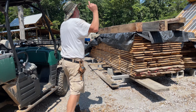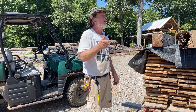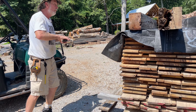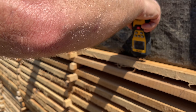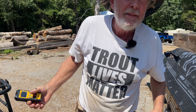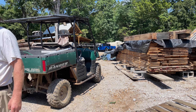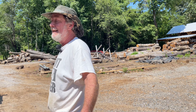We're about ready to actually do another kiln rotation. That kiln is filled and I can't remember how much white oak decking we have, so we need to get it out — it's ready. It's been cooking for a month. This is the next bad boy stack going in — this is all the hickory flooring we cut last month, been out here air drying. I've been testing everything where we're at and it's actually ready to hit the kiln and get sterilized. I'm reading 12% here — this has only been drying for a month and it's not even in the kiln yet. It's going to come out perfectly. Jay and I at some point are going to process it on our Woodland Mill saw and bring it through our shop to make ourselves some hickory siding.